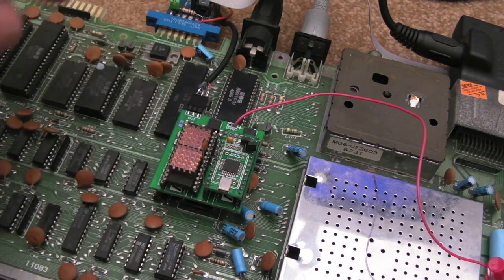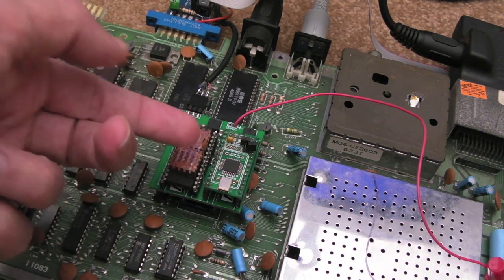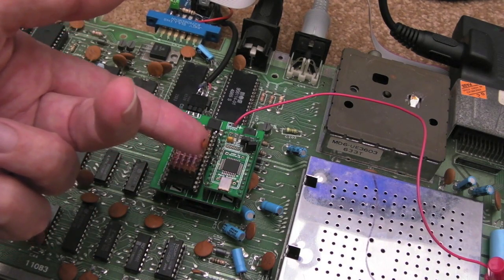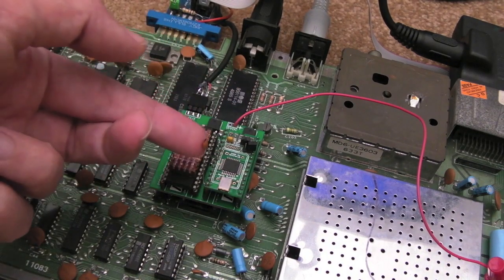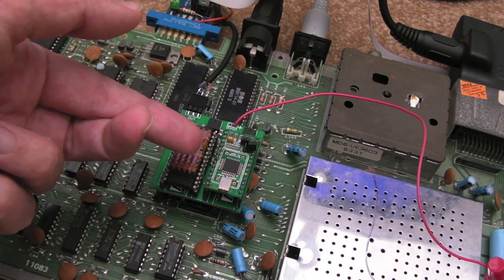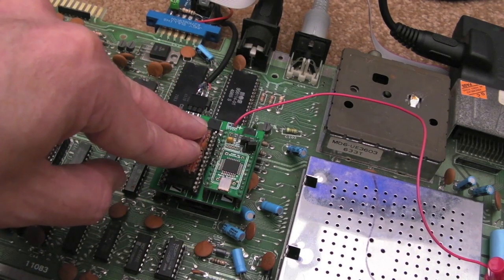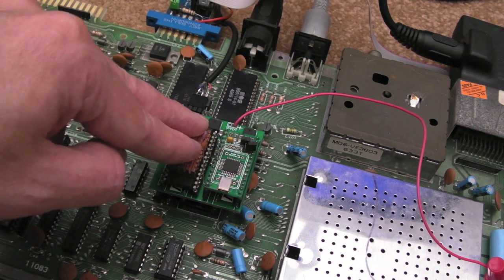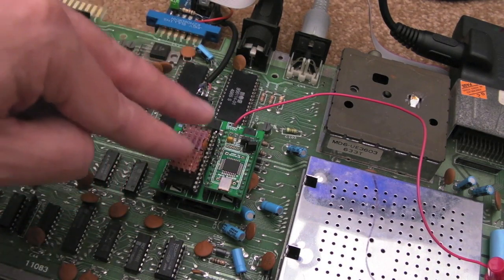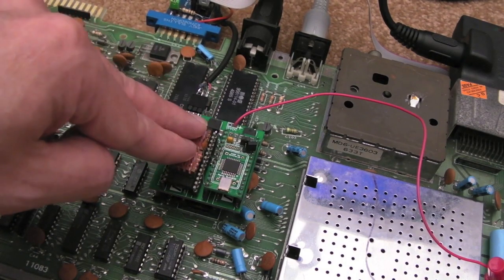When it came to implement it in the C64, 97% of things sound perfect, so you wouldn't pick up on it. Adding a cap — now I've got a 10pF cap in here, but because I'm using it with the dual SID board, 10pF might be too much on its own. If you just plug the Nano SID straight into your SID socket, you might need something smaller, like 2pF, 5pF, or 4.7pF. I'm going to demonstrate R-Type now so you can hear it's flawless — absolutely flawless — and Alien as well.